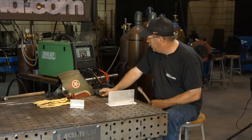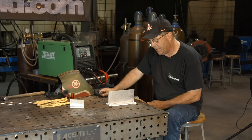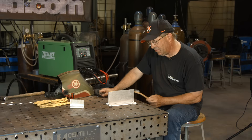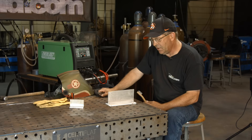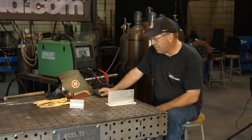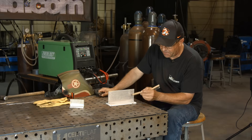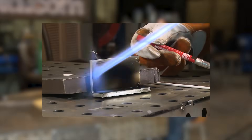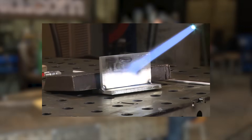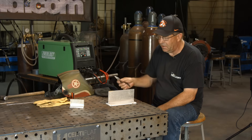Now here's the other deal. We're going off at 180 amps, but I'd almost venture to bet that I could do this with way less amperage if I preheated the material. If I had a smaller machine — say, 150-amp output DC TIG — and somebody brought me some stuff and said, can you do that? I wouldn't be afraid of it. I'd do the helium thing, but I would probably preheat this. We did a video showing a trick using temp sticks — you scratch it on there and as soon as it melts, it's up to the rated temperature. Or you can use a carburizing flame to put black soot on the material and heat it up to about 400–450 degrees. I'm pretty confident I could do 150 amps with helium on quarter-inch aluminum and make a fillet weld.